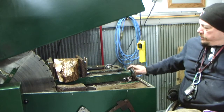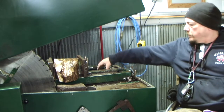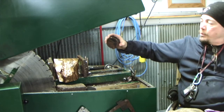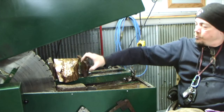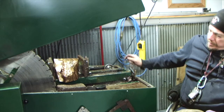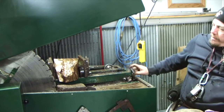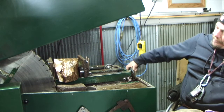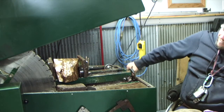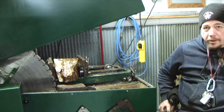So here's what I do. I'll back up a minute and open the carriage up a little bit over the vise, then reach over and pick up a hockey puck. Hockey pucks are great — they're really hard but have a little bit of give to them, so they're nice at conforming to rocks. I just stick that in here because that's gonna give me enough surface between here and there to hold this thing straight. I clamp these down pretty tight and now the rock has no movement. I'm ready to rock and roll.